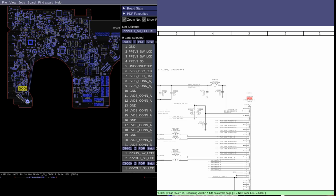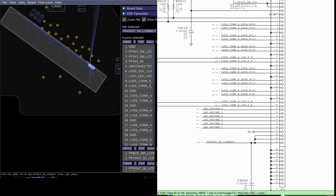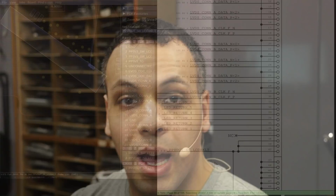So if we were to look at all the signals over here on this LCD connector, you'll see that we have 3 volts over here, then we have a bunch of LVDS data lines, and these are all data lines that are going to be somewhere between 1 and 3 volts. Then all the way at the end we have a not connected pin, which is typically going to be grounded, and then we have the high voltage of LCD backlight. LCD backlight is typically going to be somewhere between 26 and 50 volts,